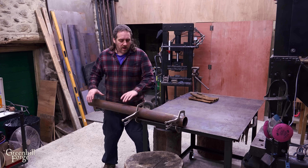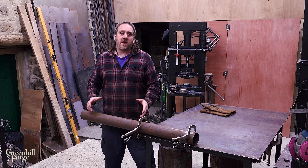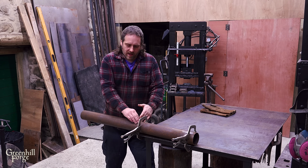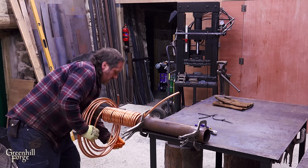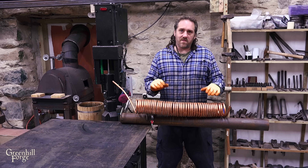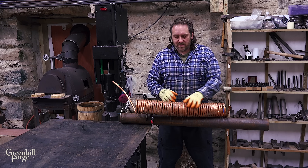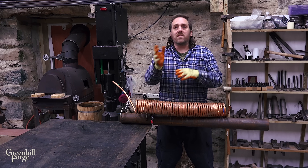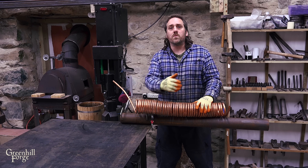It's been about 24 hours and the copper pipe should be frozen and solid. So I've got this piece of pipe clamped to this table, and I've got some big weights to try to immobilize this table. I'll grab the pipe out of the freezer and try to act really quickly before any melting can really occur, and I'll just stick one end through this clamp here and then just wrap it up down the pipe, and hopefully I get a nice tight coil. So I want them spaced so that as the hot air passes over the coil, it can touch all sides of the coils, and I also want to create as much turbulence as I can inside the heat exchanger. So as the hot air is rising up through the flue, it's moving around a lot, touching all the different sides of the copper coil, so it has as much time as possible for the copper coil to absorb the heat from the exhaust gases.